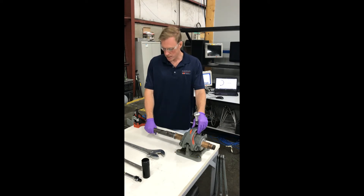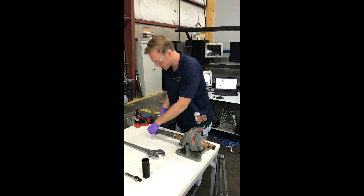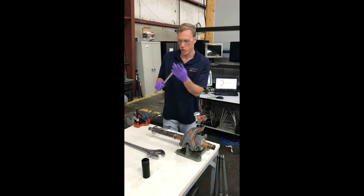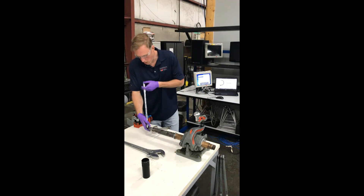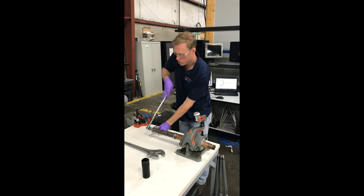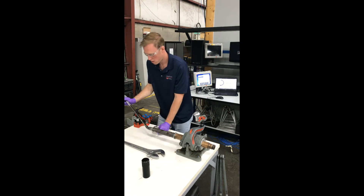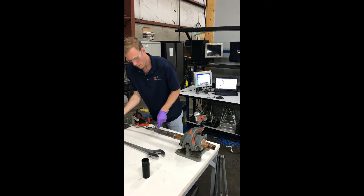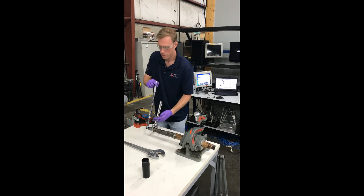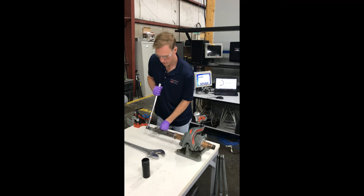The signal shaft has flats on it, so really what you can do is grab the signal shaft, and then just take a half-inch driver breaker bar and stick it in the bottom of that poppet cap and gently work that cap off. Once you break it free, it's pretty easy to then work the cap off the rest of the way.